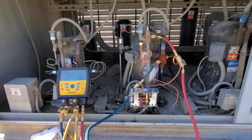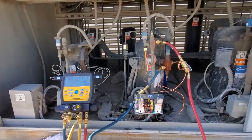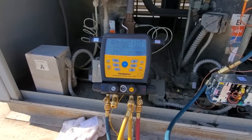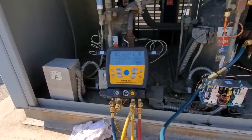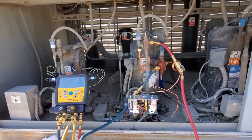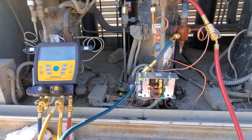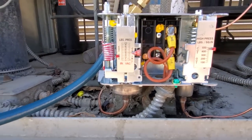Now we're up at the rack and I've already got my gauges on this. I already know what's happening, but this is an interesting problem and I want to point it out. We are off on low pressure right now. My low pressure with my gauges — the compressor is not running. My low pressure is sitting at 30 PSI. My high pressure is at 174. My system is calling, my temperature controller is set for negative 10, and my solenoid valve is open. But my pressure on the low side is not rising any higher than 30 PSI. And if we look at the low pressure control, we're set right around 30 PSI.